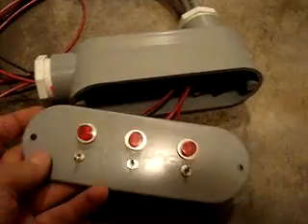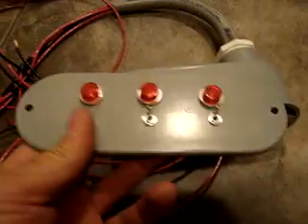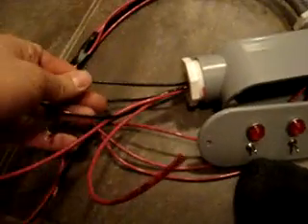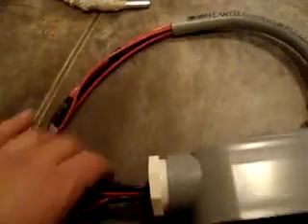I'm not done yet, but basically each 200-watt heater will have its own switch. A light will come on — it's going to be wired in there. On this end, it's going to hook into the 12-volt batteries. Each circuit's going to have its own wire because they're going to be 20 amps, so rather than having one thick wire, you've got three thin wires.